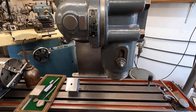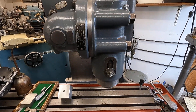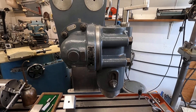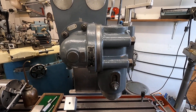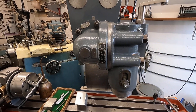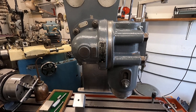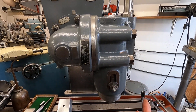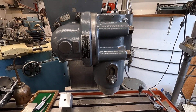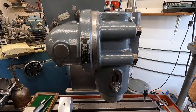In the last video I took up some of the play in the bearings. They could have put better parts in there. These machines were put out in a pretty big hurry because there was a war going on. The retaining washer just used punch marks to keep the nut from backing off - and it backed off. The nut slipped off and that's why it had play. So I tightened it back up and used a chisel to raise the metal to hopefully keep it where it's supposed to be.